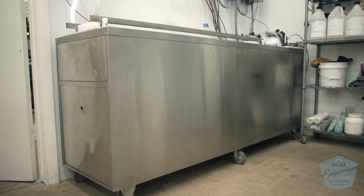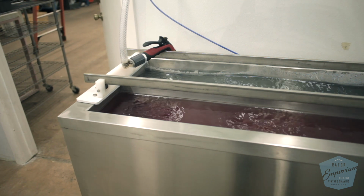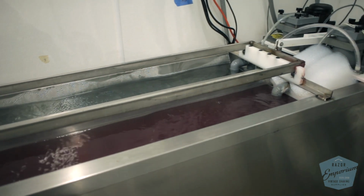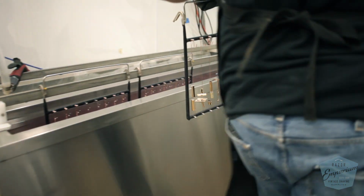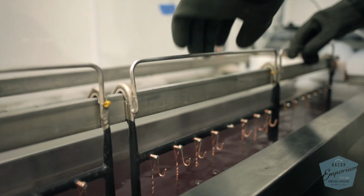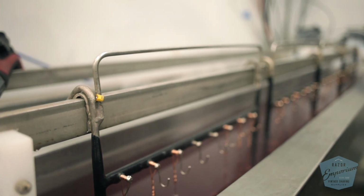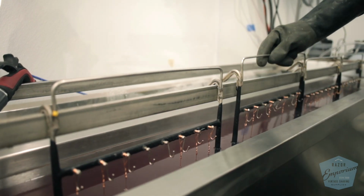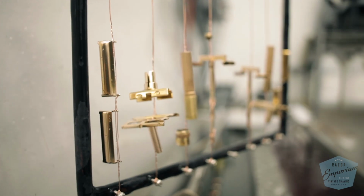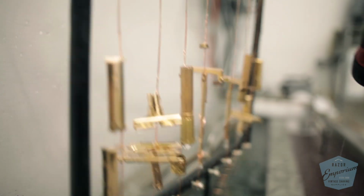And we also have the large machine that's kind of a custom unit that I've built that actually came from a blinds cleaning company, and we've kind of retrofitted it to work for razors, and it's now in our laboratory. It's being used for cleaning multiple racks of razors before they go into the plating line. So we do cleaning at the bench top with the razors, but then even when they're racked up and they go into the plating lab, they're going to get another round of ultrasonic cleaning just to make sure we have every little bit of polishing compound removed so you have the best possible outcomes for your revamped razor.